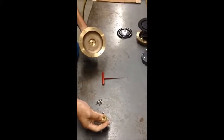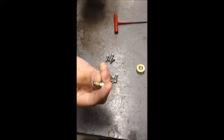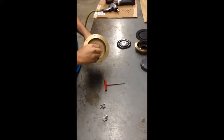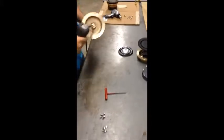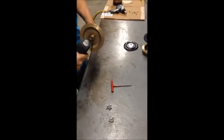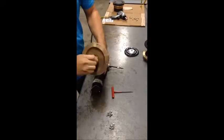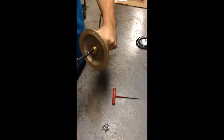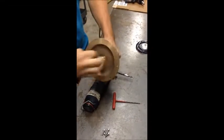He's going to take our pad and screw. On a new screw, it's going to have a little bit of the Loctite type solution that's going to hold it in place. On a used screw, you can just put something like a purple Loctite, something that is removable later. You'll notice when he tightens this up, he's not going to over-tighten it. He tightens it to where it still can rotate — it's snug but then he loosens it to where it can spin freely, yet not wobble. That's going to help it not bind on the diaphragm later.